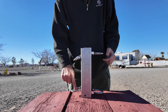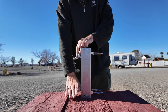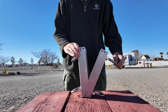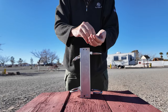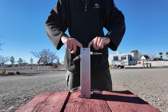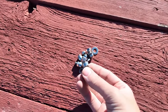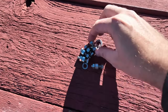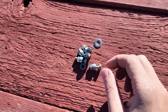Now with this thing all together, you can put one pole in one side and one pole in the other side. One would go ideally three feet into the ground and the other would hold whatever your favorite mast is, and then you can tilt it over so that you can work on it. When it is up and running, you can take your last set of bolts and nuts and secure it in place so that it doesn't come apart. Pretty cool. And because this is a universal kit, I had some parts left over — I'm not really sure what you would use this part with the bearing for — and you have more ways to secure your mast in the locked upright position if you wanted.